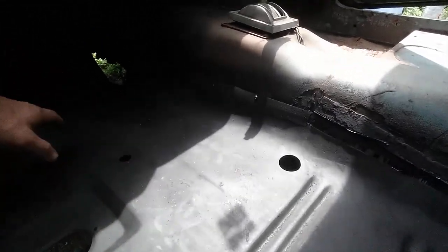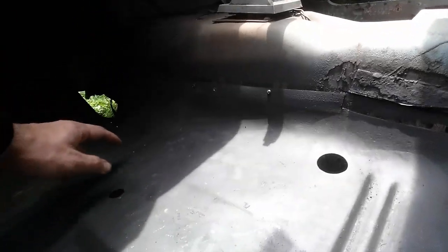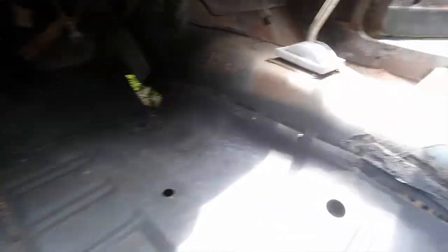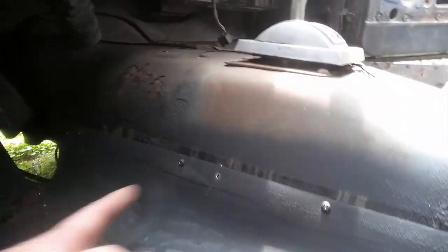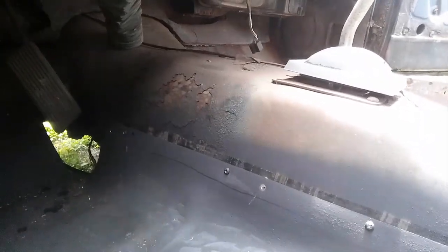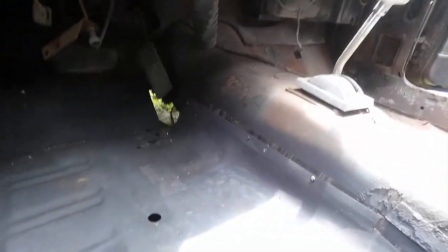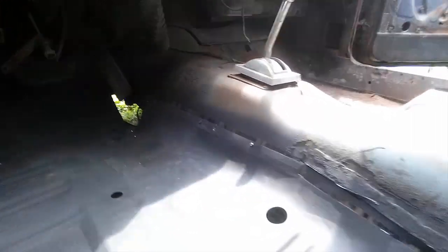There is a frame rail here. When you jack the car up on jack stands, make sure not to put any jack stands under this frame rail because it'll tweak up with the floor gone. There is a rail here — slam it down with a sledge hammer or something. Originally I had the floors in a little bit too high and I had to lower it substantially once I got under the car and realized it wasn't going to actually touch the cross member.